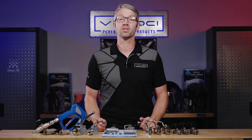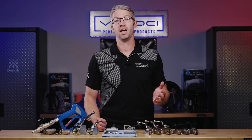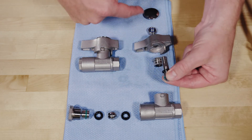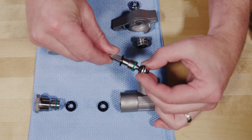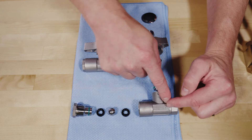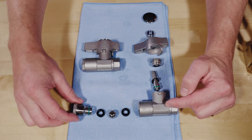Using a ball valve out of its spec temperature range can cause big problems — the seal can expand and you won't be able to turn the ball valve. All of MTM Velozzi's ball valves range from 176 degrees maximum up to 215 degrees. If you exceed that, your seals can expand and the ball valve will no longer operate. The handle connects through a series of retaining nuts onto the stem. The assembly order for the seals is: one seal on one side, then your ball — oriented with the keyed portion on top — another seal, and a retaining nut holding everything together.